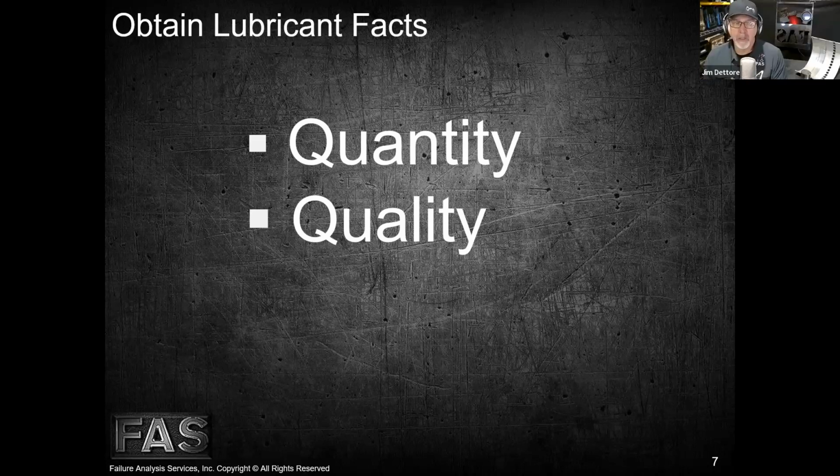So it's designed into the unit that's going to be placed into service. If they're running a full duty cycle like in gas compression, then they're going to have a particular sump size for that horsepower displacement of the engine and the horsepower rating of it. And with compressors, I have to say, it's whatever the manufacturer recommends.